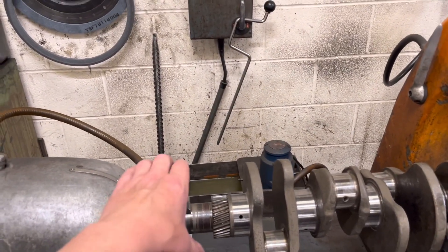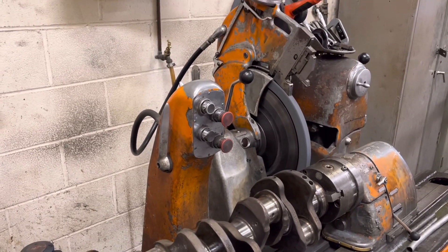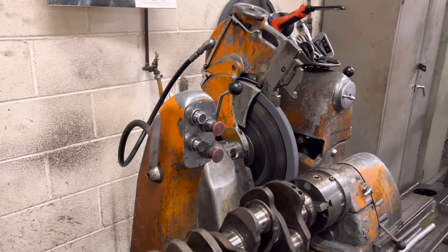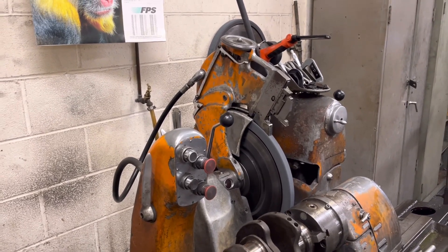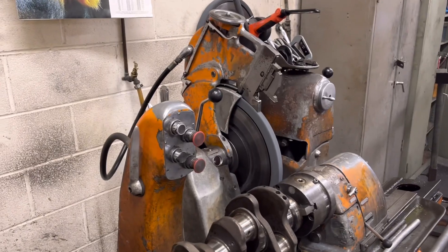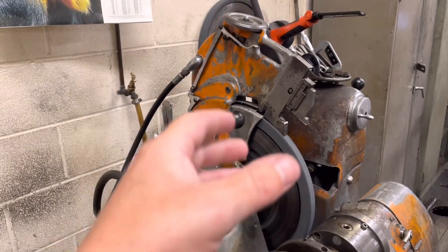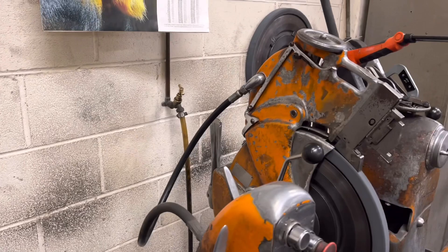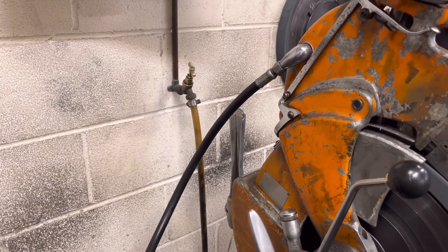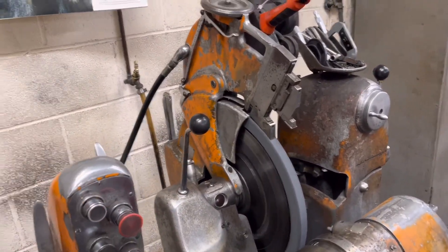Basically to set this up you've got adjustment screws over here and you have to stick a clock on the mains and clock it in and adjust it wherever need be. The wheel up there — he's just bought three new stones which he's had to put on the wheels. When you do that — same as when you face the wheel — you can knock it out of balance. John says when you put a new stone on it can be horrendously out of balance. You can tell straight away when you fire it up because you can hear it rumbling about. That little gauge at the back is like a spring gauge, and you can see it's not far out now but a minute ago it was all over the place. I'll show you how you balance it — you have three adjusting screws and three weights.